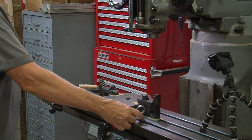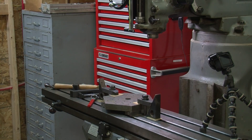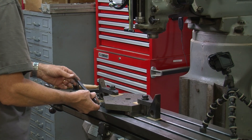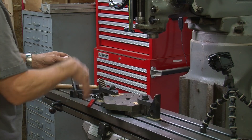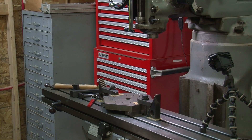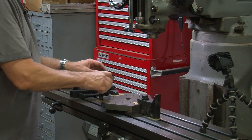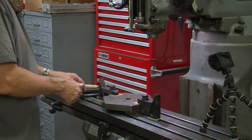That's about it for the step blocks. They're handy and can be used in many situations. Here's a long one — believe it or not, it has coupling nuts that allow you to make them even longer, so you could work on some really tall objects and clamp them down with this. The two most important rules: always use at least two clamps, and never over-tighten a clamp to where you could actually damage the table.